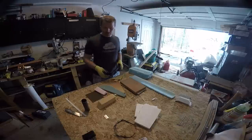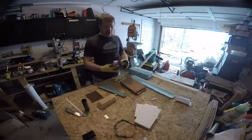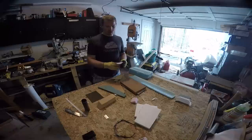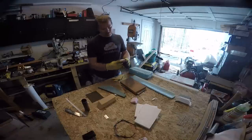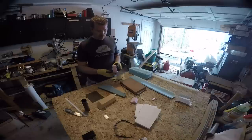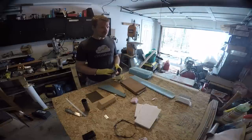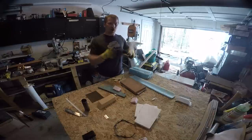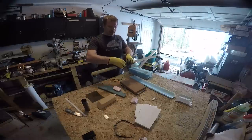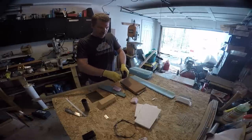This is another kind of foam you can get at your home improvement store. This is much more rigid — it'll break, but it'll break cleanly. It's a very closed-cell foam, so there are no gaps where water can seep in, and it's very stiff. That's important because the purpose of the foam is to provide both the shape of what you're making and crush resistance. Fiberglass is very strong in tension, compression, and torsion — this is only two plies of BID and I really doubt I could tear it by hand.